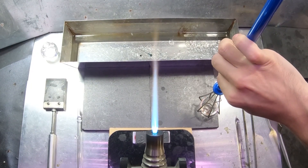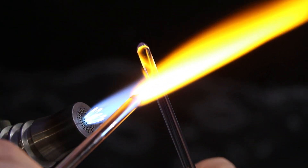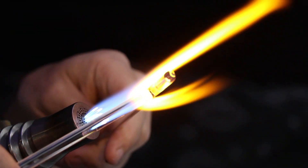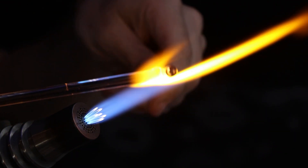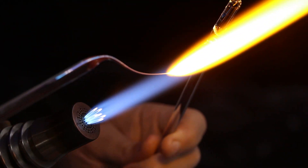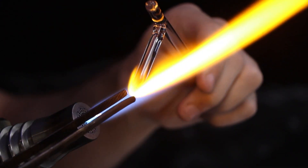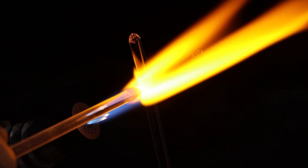I'm going to hold the jar vertically and as still as I can to get a nice flat bottom. Flattening a vessel does take a little bit of practice — you don't want to lift it too quickly as it could still be molten and begin to slump. I'm thinking I may try a slightly different method here: instead of pouring the bismuth out of the container, I'm going to create a little glass tool that I can dip into the top to make nucleation sites, and then hopefully pull out a crystal.